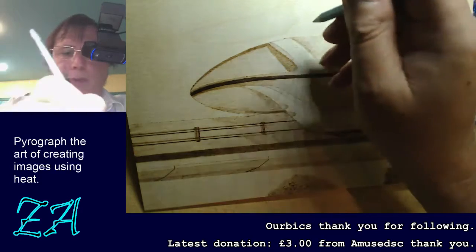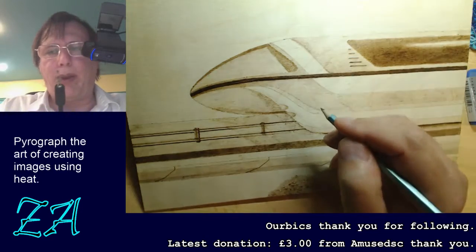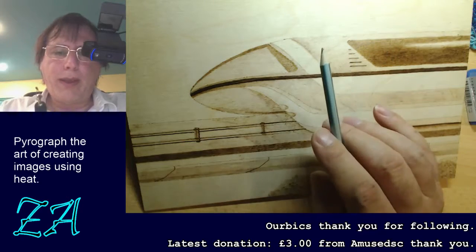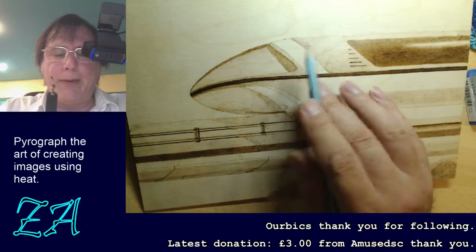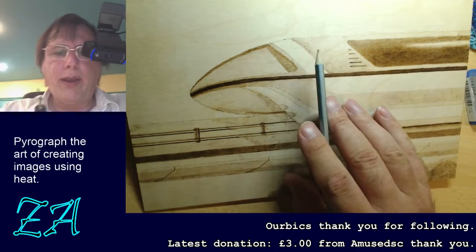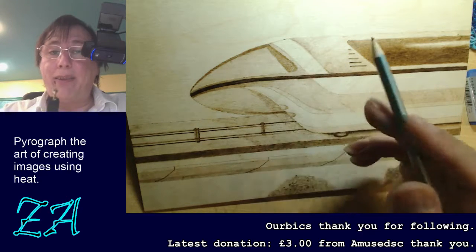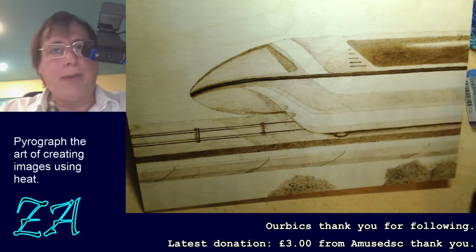It's very easy, especially with the tip, to push it, hold it against the wood, especially if you're trying to make the rings go dark. If you hold it sideways, you don't put as much pressure on it. It tends not to shrink away from you quite so much, although you possibly find the wood looks a bit like you're pushing clay. But if you use the pens, the soldering iron tool or similar sidewards, it will tend to heat the ring areas up for longer before you get to them with the tip, which is where most of the heat is. So that might help, but I don't like working with pine, to be honest, for that very reason.